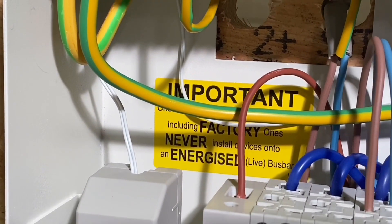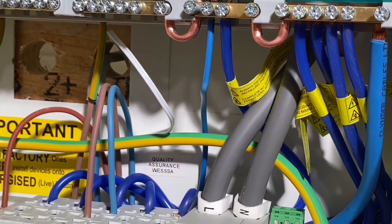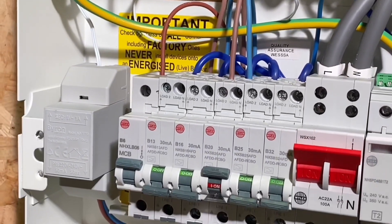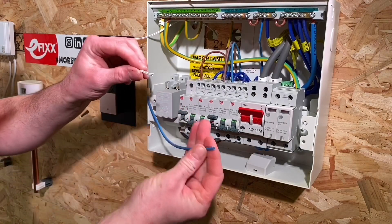This is the problem that Andrew was facing on site. You can see that bell wire twisting its way around all of the other cables in the consumer unit. We've got the two different voltages we discussed, and that becomes an issue because we don't want the voltage from the mains cables to appear in the one that's actually 8 volts.